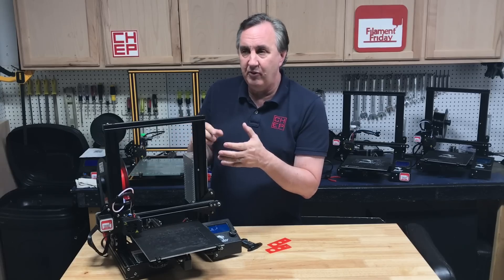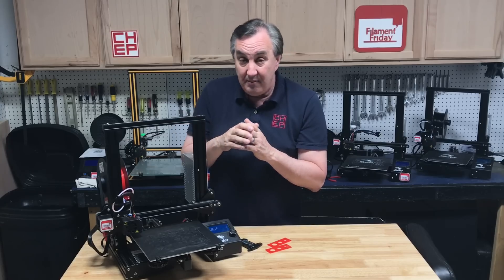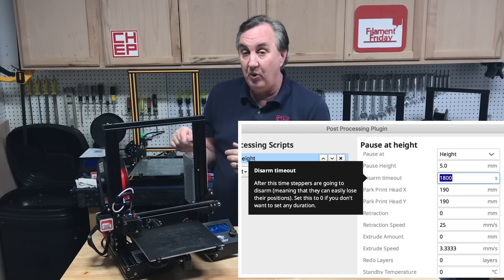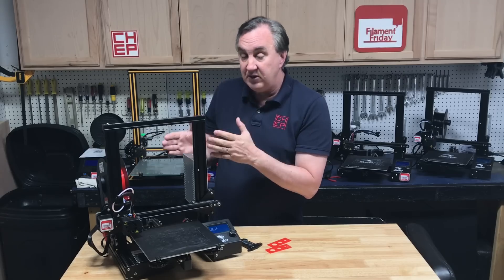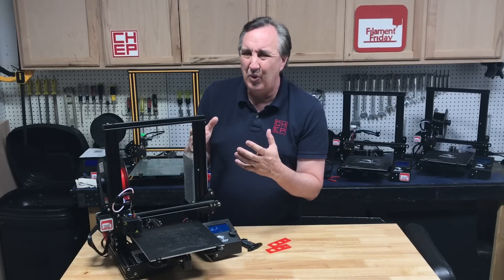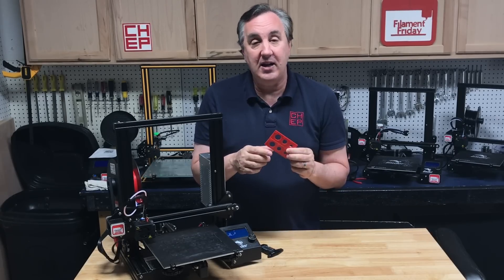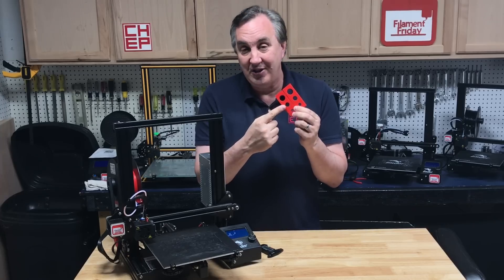So I'm going to set up a machine to really produce some good or really bad elephant's foot and see if I can correct it with that. Another thing I'm working on is changing filament at height. There was a multi-color test I did in a previous video where it would pause and you'd change the filament for multi-colors. Some people were reporting in versions 4.4 and 4.5 that the z-stepper motor wasn't holding and would slip while changing filament. Apparently that was an issue, because in 4.6.1 they've fixed it — now you can set how long you want the z-axis motor to hold, up to 30 minutes.